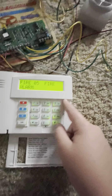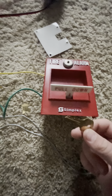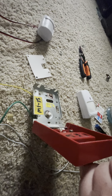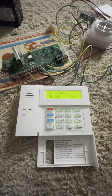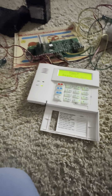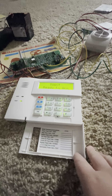I have the alpha descriptors programmed to fire alarm. Let me shut it up — that has silence. As we can see, the alpha descriptor on zone 5 is programmed as fire alarm and it's hooked up to zone 5. I have a B key here — I'm going to reset it. This one just has a button and spring-loaded so you just have to close it.